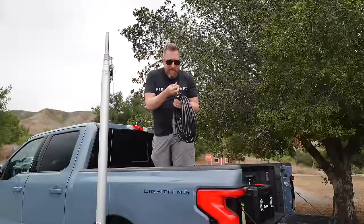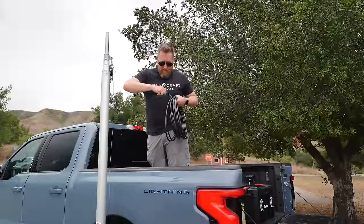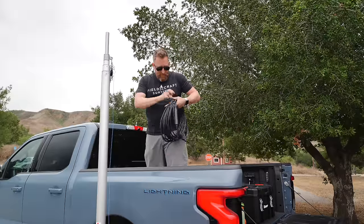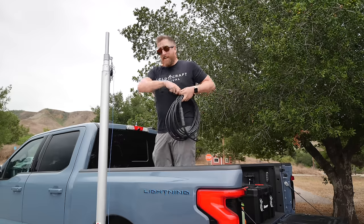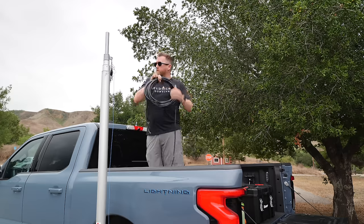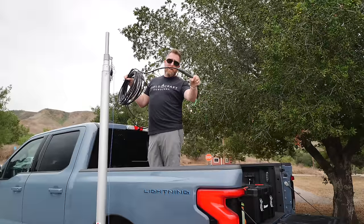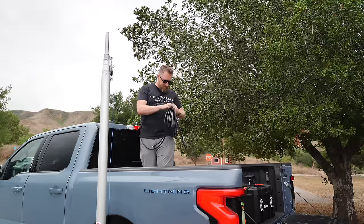Ah, end fed, meaning the choke needs to be on the radio side. You will need the choking to be done right before the radio termination, not at the antenna side. You need the coax braid. So if you get that ABR coax like I recommend with the choke on one end, this needs to go to your radio. If this were a dipole configuration, you'd have it at the antenna side.